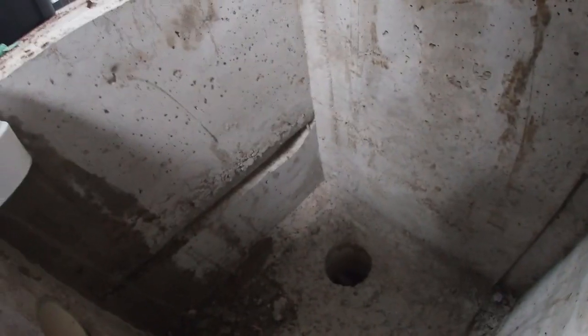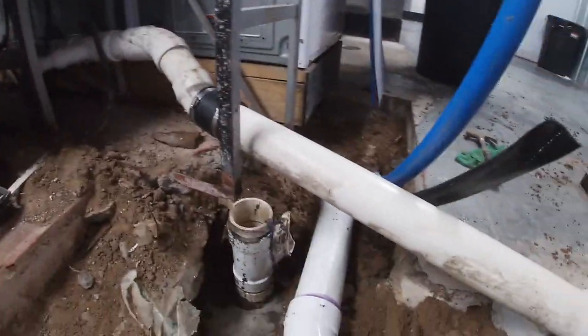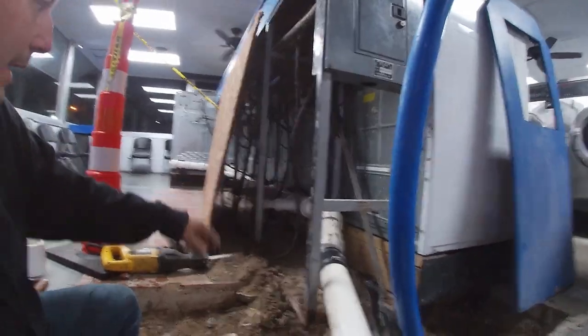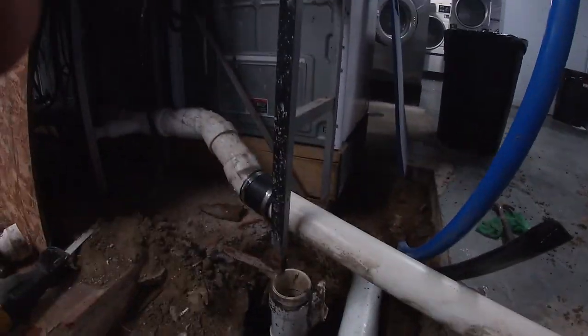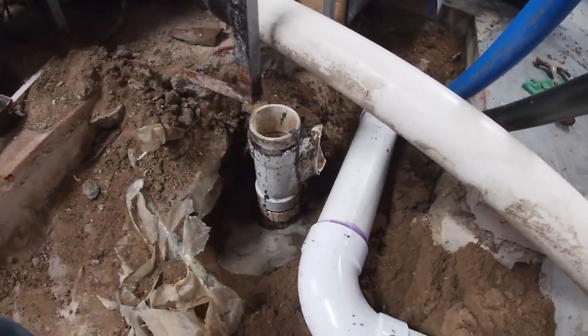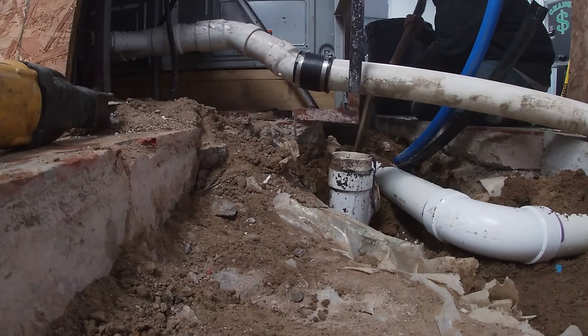There it is, peeing out here for me. I'm gonna clean this up real quick, but it's working just like it's supposed to. Now, the reason I'm doing this is I really hate to waste the fittings or something I know I'm gonna rip out, because that island is coming out. There's no sense in gluing these together for now. People won't be touching this. It'll be okay for now, and there'll be no back pressure. I will tighten that boot, but there's just no sense in it. So we're just gonna tempt that. We're gonna go ahead and rip this out.